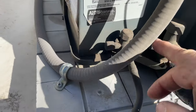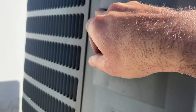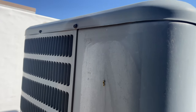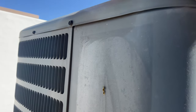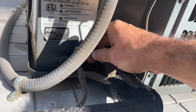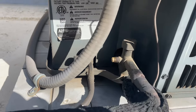You can see signs of oil everywhere — the dirt sticks to it. There's an oil mark right there going up to here. These particular Goodman condensing coils leak up here; I've made a couple of videos repairing them and finding the leaks. But no repairs today — this is going to be a gas-and-go, and I'll let the supervisor know what's going on.